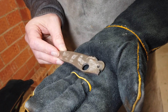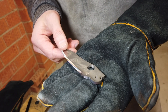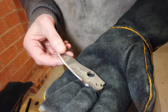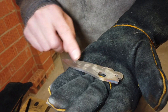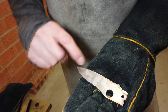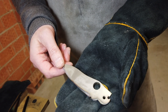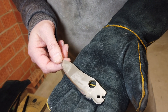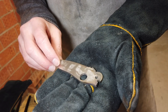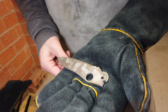I think the discoloration is probably from when I actually quenched it — it's very mild compared to what I sometimes get. Not as clean as I would like, but I think that's probably more the foil packet than anything else — it probably punctured slightly on one of these corners, either when it was going in or when I quenched it. Overall, if I can avoid the sticking and end up with a finish like the clean areas rather than where it stuck, that's going to be a great result. I'm going to put this into the liquid nitrogen now and then put the other blade in for heat treatment.